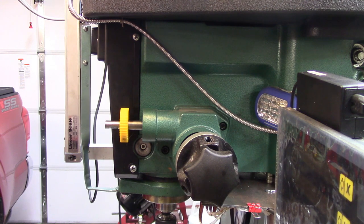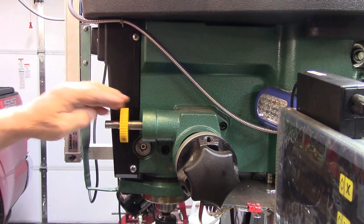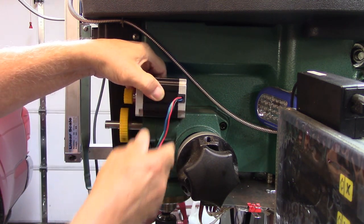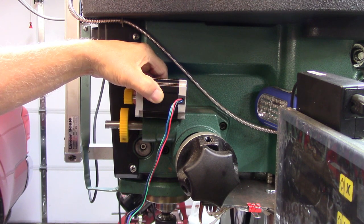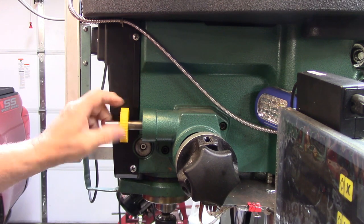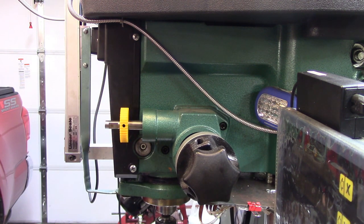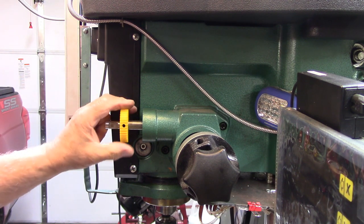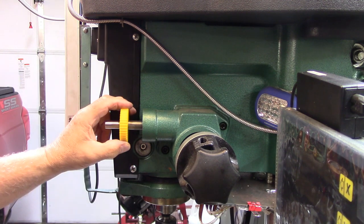So that I don't head into this job totally clueless, I thought it's time for a sanity check to see if I'm going to have clearance back here for the motor if I use gears. That's not going to work no matter what kind of imagination you've got - there's tons of distance between the two gears. I've wasted my time and others' time starting on these gears, and the motor gear is too small to be done with plastic - it split when I tried to thread it. Obviously I'm going to have to do this with pulleys. I could put the motor out at the end but that gets in my way - that's the way all the CNC guys do it anyway.